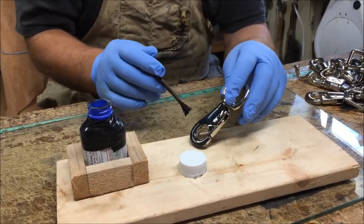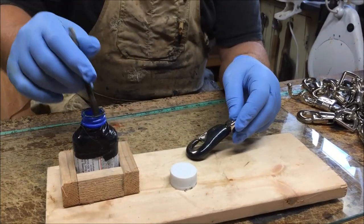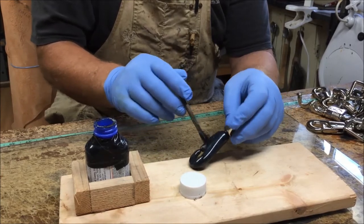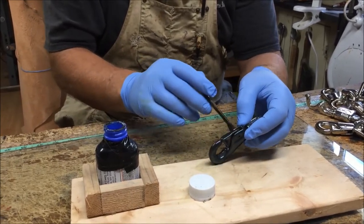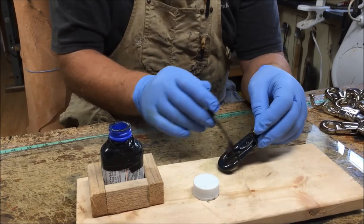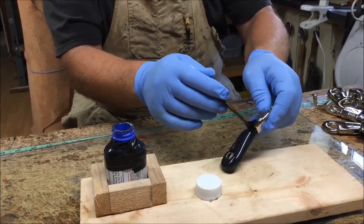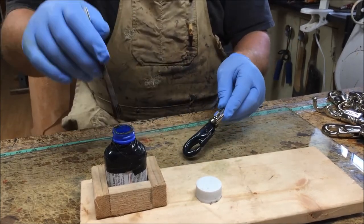Some folks would say why don't you just take a container and dip everything into it, submerge it all the way together. One of the main reasons we don't do that is because in the past we tried it and found that the solution gets onto the spring and the mechanisms and weakens the spring. It's the same reason why we don't drop these into our forge and heat them up nice and fancy — because we don't want to take the case hardening of the spring out. If you get it red hot toasty you're going to take that hardening out and the springs will snap easy — the elasticity of the spring.